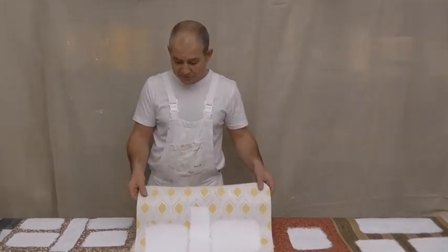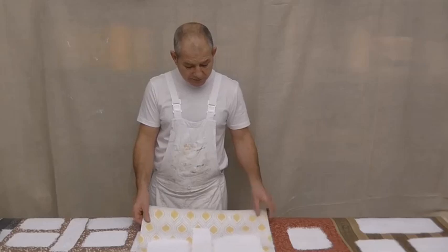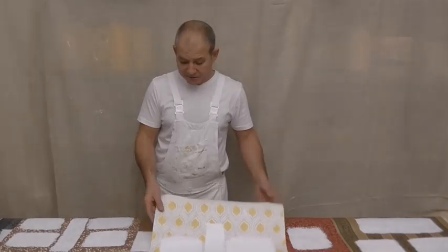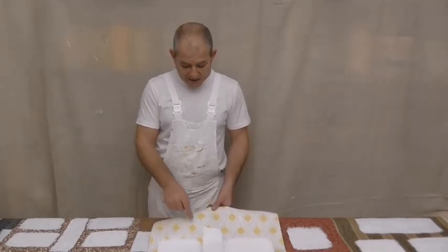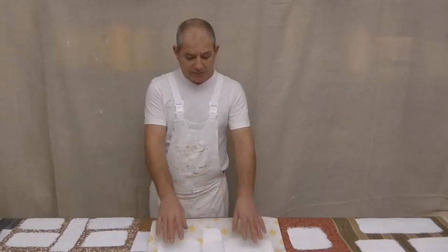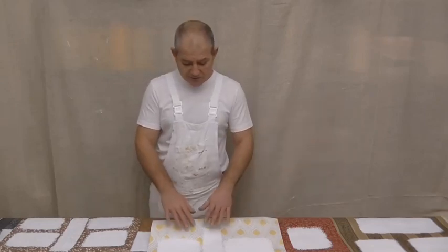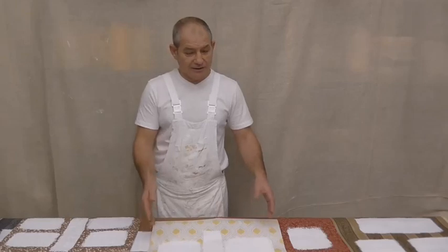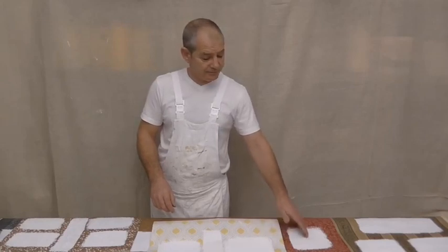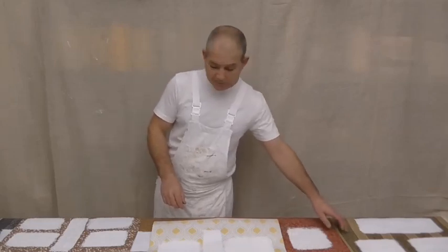Even smooth papers, so this is a wipeable paper, not completely washable, just wipeable, very smooth, almost like a good quality lining paper. Anything like this, any bad joints, any lumps behind the paper, any uneven plasterwork, once you get the paint on, is going to be very visible, especially these joints down the wall. So you may think it's smooth, but it can just look 10 times worse when you put the paint on. Textured ones, a lot better, but again, you're going to be left with that pattern on the wall. So this one's a striper one, but we'll have a look at them in a minute.